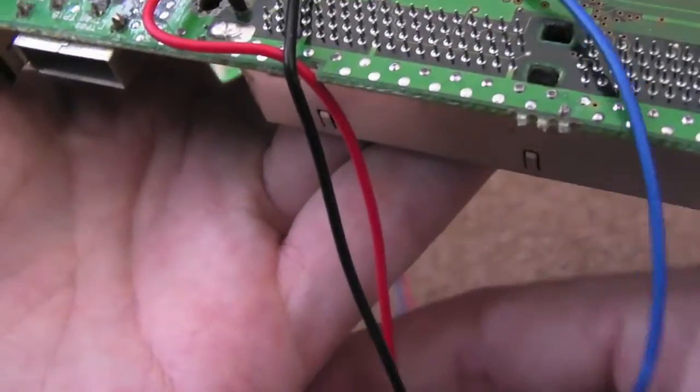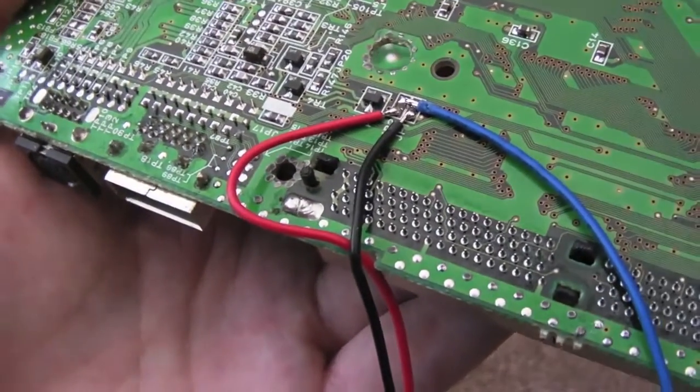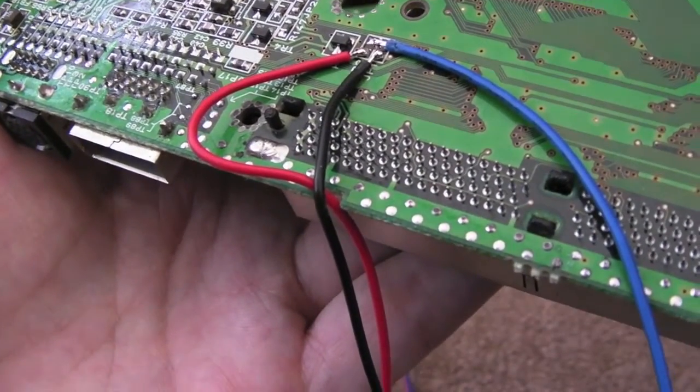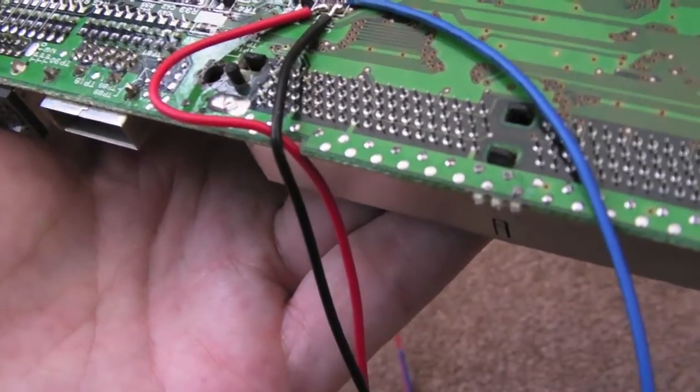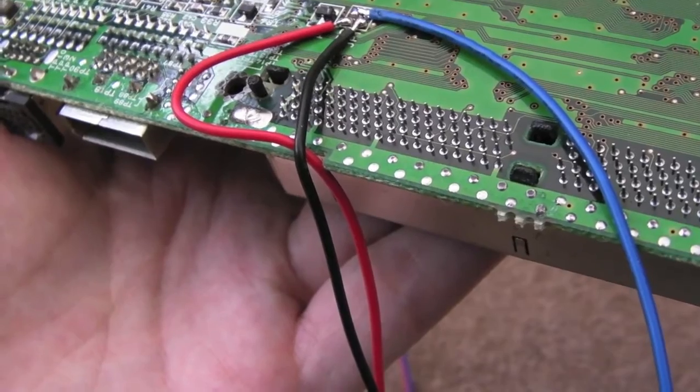And that's it. The 3 wires then go off, and the blue wire will go into the centre pin of the switch, and then either side of the switch goes to the red and the black. So I'll now get this back in the case with the shielding on, and carefully reassemble it before I work out what I'm going to do with the switch, I think.